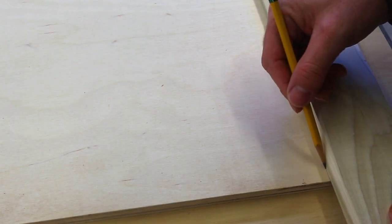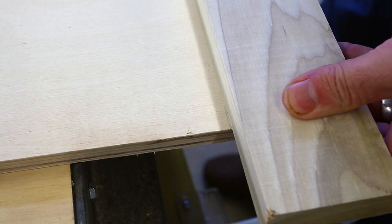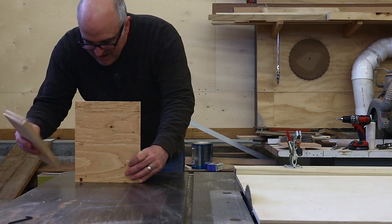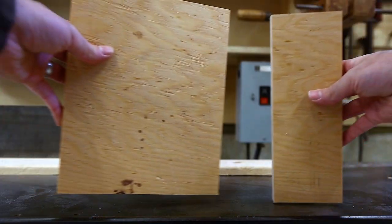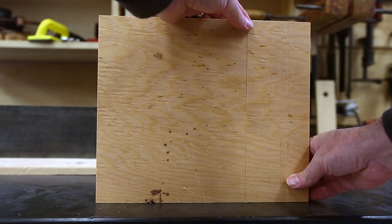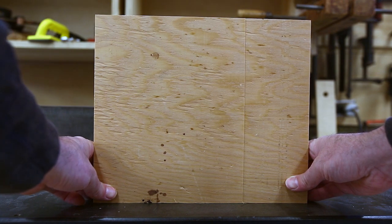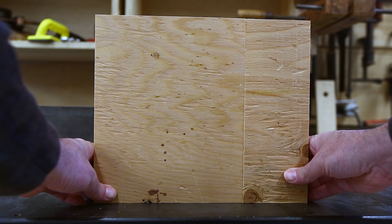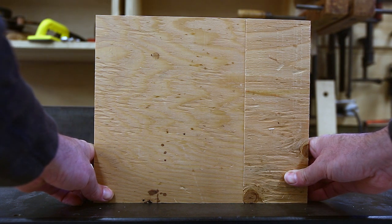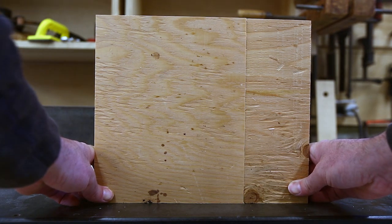I found I was off by just barely what I could see. I moved the stop probably less than a sixty-fourth of an inch at four feet away from the blade, and that did the trick — it seemed pretty tight at that point. If I put this on the flattest thing I have, which I think is the jointer table: there's the original cut, and if I flip half around it should also be perfectly tight — and if it's perfectly tight, then by definition it's square. That looks pretty good; I'm about perfect.